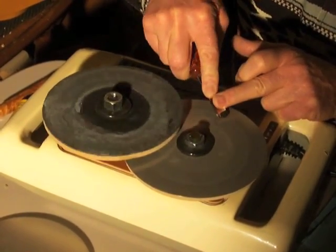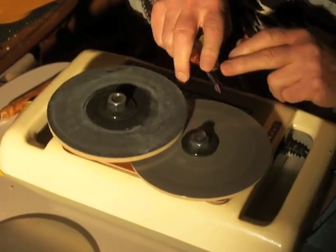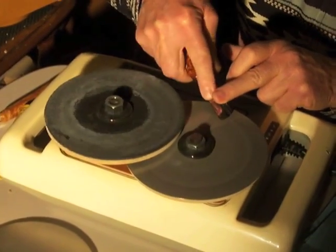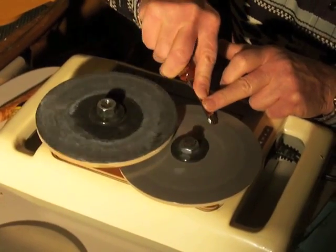If you roll your gouge over completely up on the wing, you'll end up starting to curve those wings back. So if you like a good straight gouge, just be careful on how far you go over with your roll while you're sharpening.